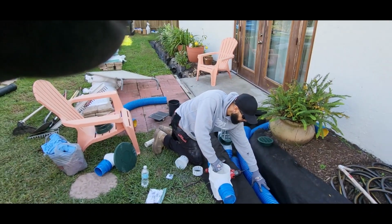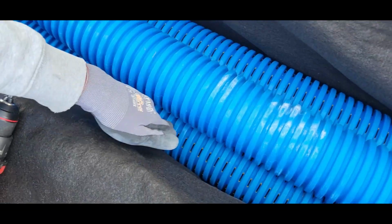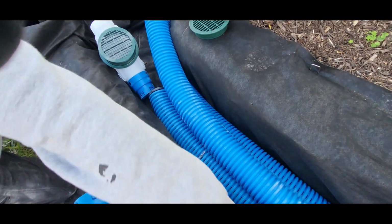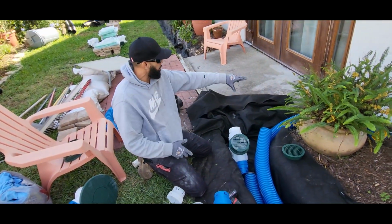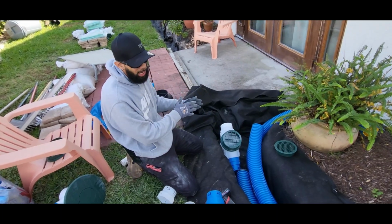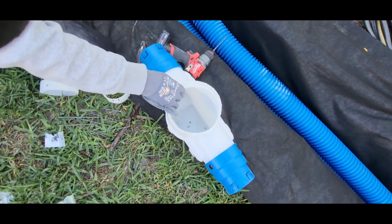We have a double pipe French drain system right here. Two perforated pipes at the bottom. Now we're getting the downspouts with the solid pipe all around, but we want to catch any amount of bulk water. We're having an open French drain through here, so I know we're going to catch a lot of water. But just in case of a big rainstorm, I want to put a catch basin.